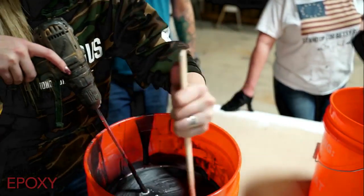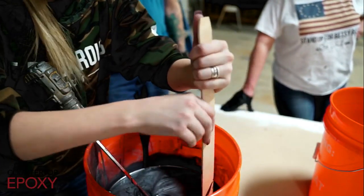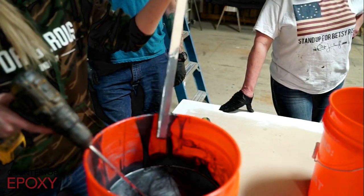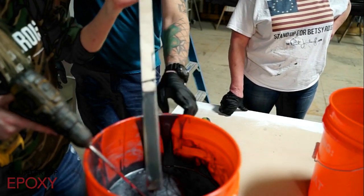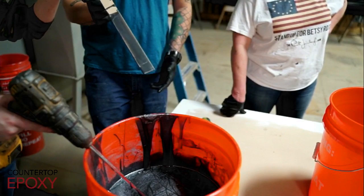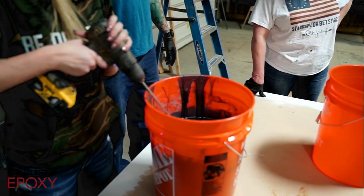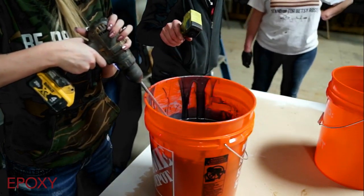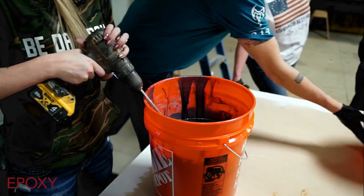That black plastic is just like a painter's drop cloth plastic, and we use a metal foil tape. Oh, that guy says liners for the buckets are awesome. You can just peel them out and toss them. That's a good idea. Thanks for the tip. And then we tape that plastic down, and after it cures, so we won't try to clean up today, we'll clean up tomorrow. After it cures, we'll just pull all that epoxy plastic, and it comes right off. That's how we manage messes. When we pour out of our buckets, we stick our buckets under the table on that plastic so we don't have to worry about drippage anywhere. We have everybody check their shoes and make sure they're not tracking any epoxy onto our regular floors, especially in our showroom. We're pretty proud of that, so we don't want epoxy everywhere.